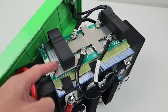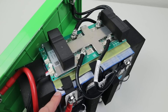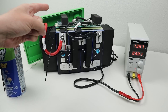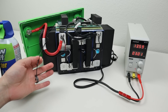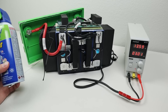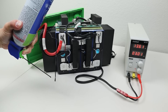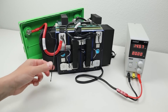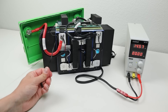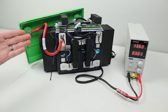There's a white sensor that goes underneath the plate — that's usually for high temperature shut off. There are also black wires for low temperature charging protection. I'm going to test that out. I have my adjustable power supply charging the battery at three amps, and I'm applying a cold temperature to the sensor to see if it stops charging. We applied the cold temperature and it stopped charging — the low temperature charging protection kicked in. After warming it up, it started charging again, so low temperature charging protection works on the BMS.